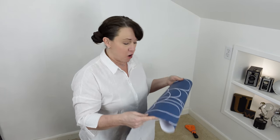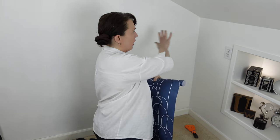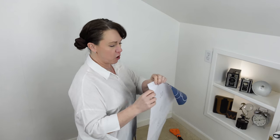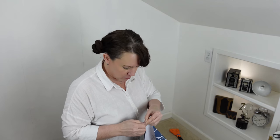This first piece is always the hardest, especially since I'm at this weird angle and I'm in a corner. I do think I'm going to go ahead and wallpaper this wall also, and because of that I don't actually want to cut it down the corner because my corners aren't square. So I'm actually going to wrap the wallpaper and press it in so it goes around the corner, which is going to make it easier in the long run. Okay, I'm going to go ahead and do this. You only want to peel off the corner a little bit at a time — it's hard to get it started.